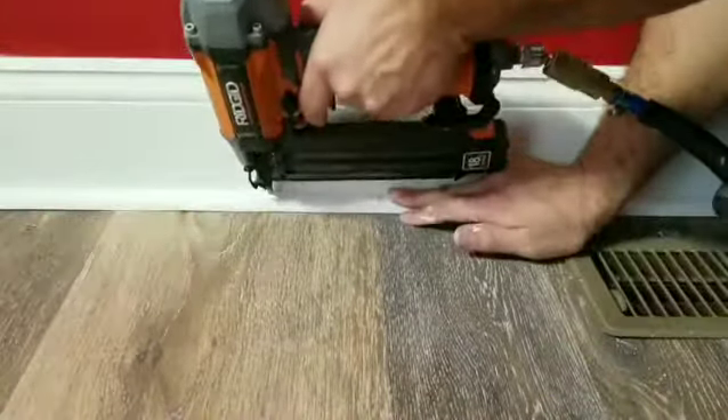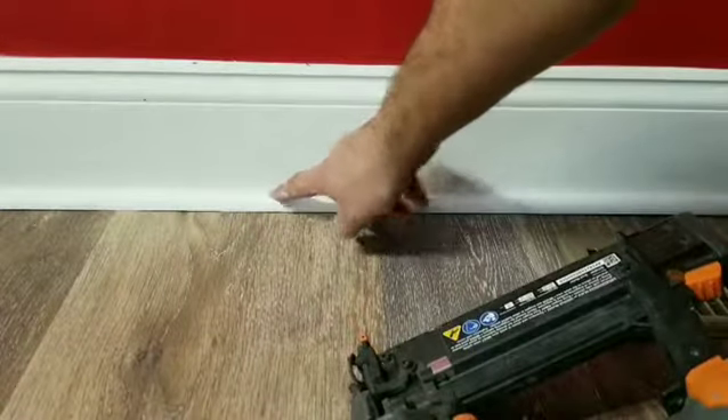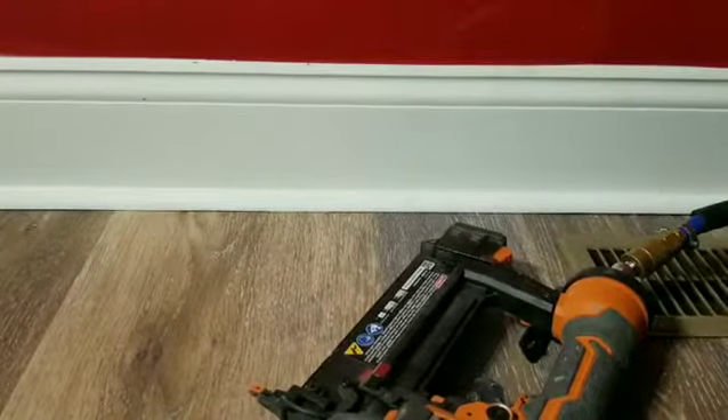When I shoot in my shoe molding, I nestled the tip right on top of the shoe molding at a slight angle, as close to the edge as possible. This way, when I go to caulk the joint, it fills the hole, making less holes for me to fill and more time saved. Thank you for watching.